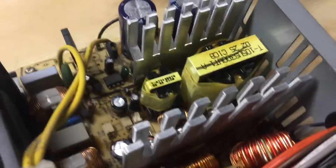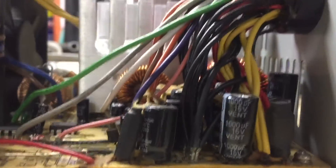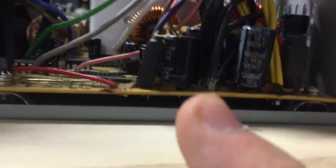Here's the inside of the Beztek ATX250-12E. I'm not sure if that means it's bad or if that's just melting glue from the heat of use, but look at that capacitor — that one right there looks like it's slightly popping off. That capacitor is cockeyed; it's halfway off the board.